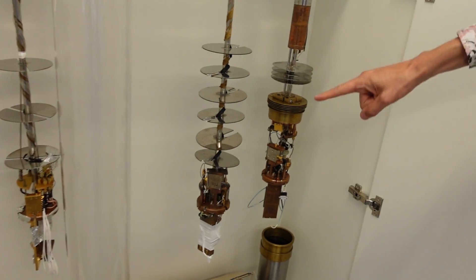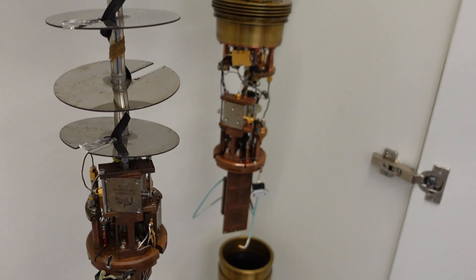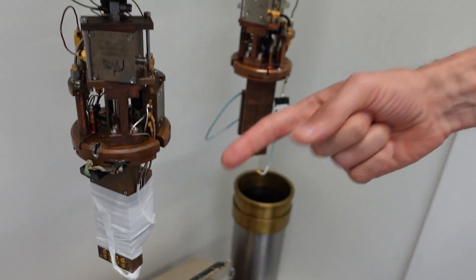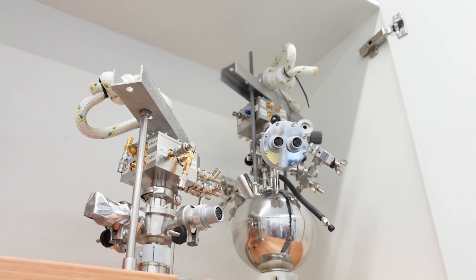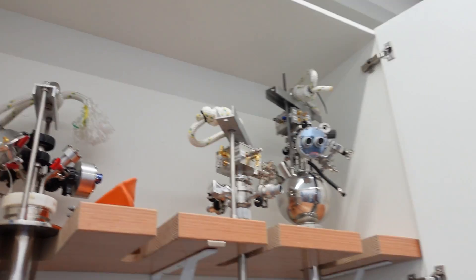This is the insert that goes in there — the same chip you saw at the bottom of the tail in the fridge can attach here. This stick gets dunked into that bucket of liquid helium and you can pump it to go to one and a half Kelvin in maybe 20 minutes, whereas the dilution fridge takes two days to cool down.